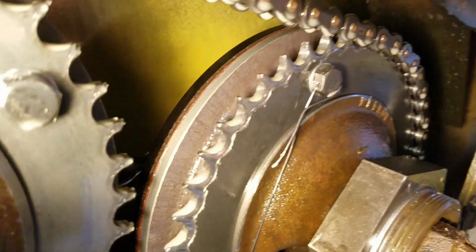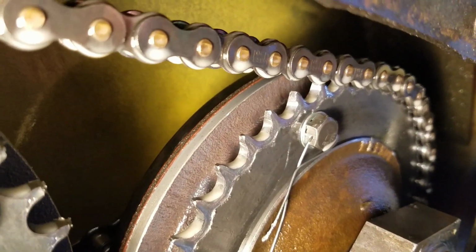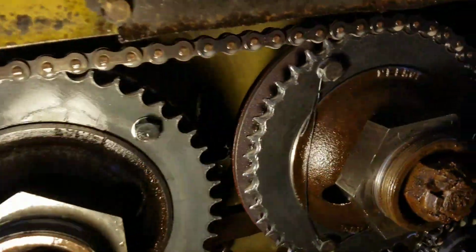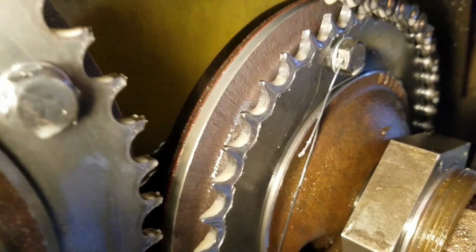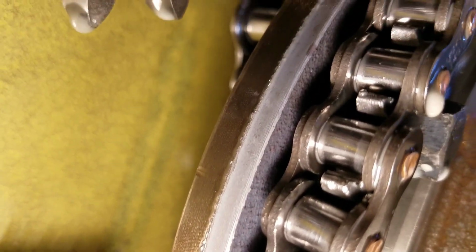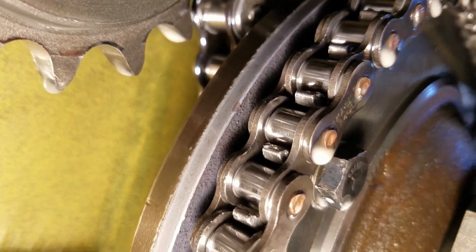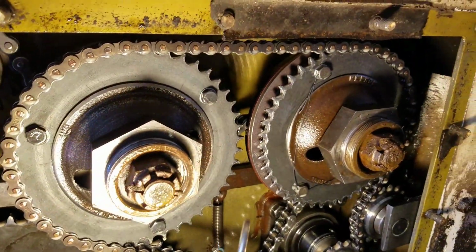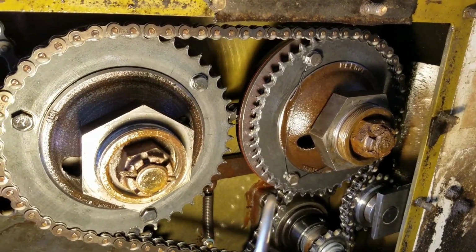But things I noticed right off the bat. Look in there, see that kind of orange-ish color there? That's the actual clutch disc. And then if you look on this side, you don't see that. See how that is there? Clutch disc material in there. And you come right over here and you don't see it, and you see little metal shavings and stuff. Clutch disc just basically disintegrated.